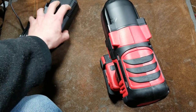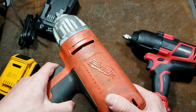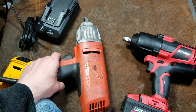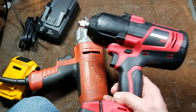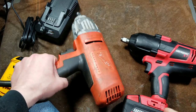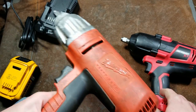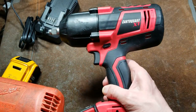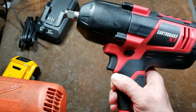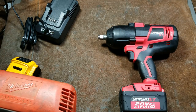The videos have shown it hitting pretty hard. I'll do a comparison against my Milwaukee corded half-inch, rated at 300 foot-pounds with a seven-amp motor. There is a difference, and it isn't always about more power — you want a balance of speed and weight. This Milwaukee, with far less torque, is a few pounds lighter. The Earthquake delivers so well because it has a huge hammer — that hammer itself probably weighs two or three pounds of steel just in the gearbox.